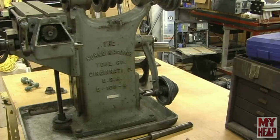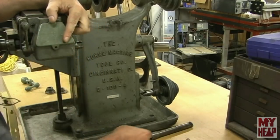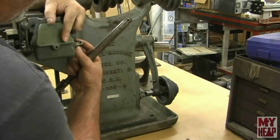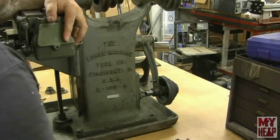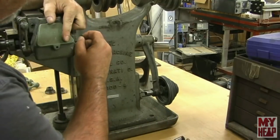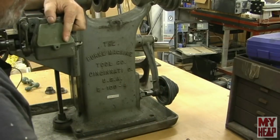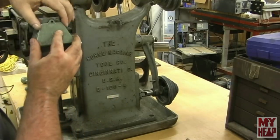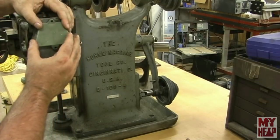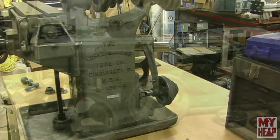The next thing I'd want to logically take apart would be the drive mechanism. Normally this plate is bolted here. You have a telescoping drive arm that connects to this pulley and then runs up to this yoke. This was off when I got it, but there are a couple of pins here — they look like roll pins. I'll take that off and then concentrate on what's in here.